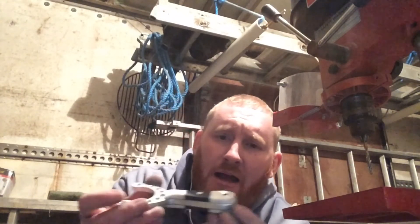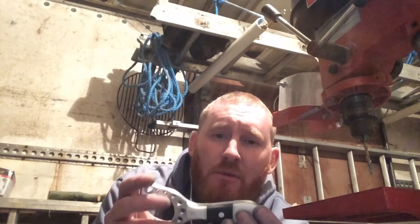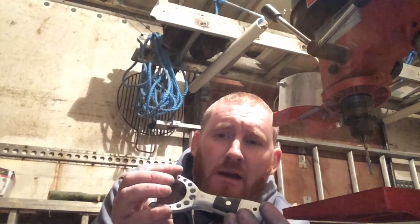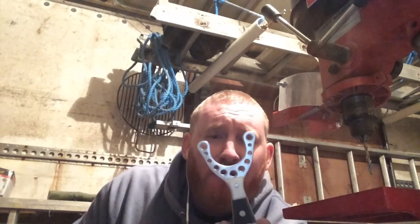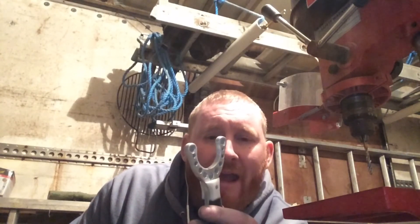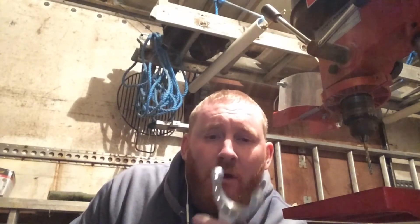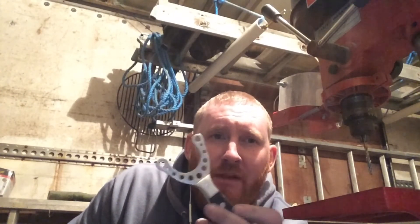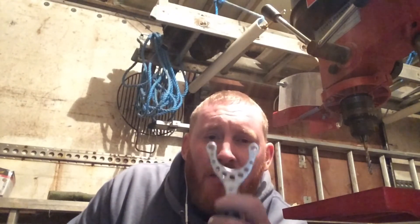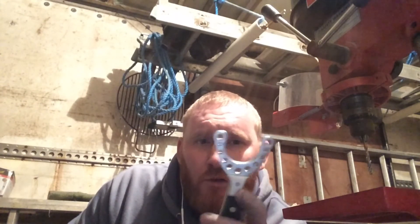Next step: I'll wash this over to keep it clean, then go on with the sanding process. There's no point doing more videos of me sanding because there's nothing I can really show you. It's just a matter of getting stuck in and going for it — putting plenty of time and effort in. 400 grit next, then washed over with a Brillo pad, then 800, 1200, 1500, then 2000 grit wet. I'll also wash the catapult in between each grit. The 3000 is a gritted sponge — I'll wash it in the sink, and then it will be polished.